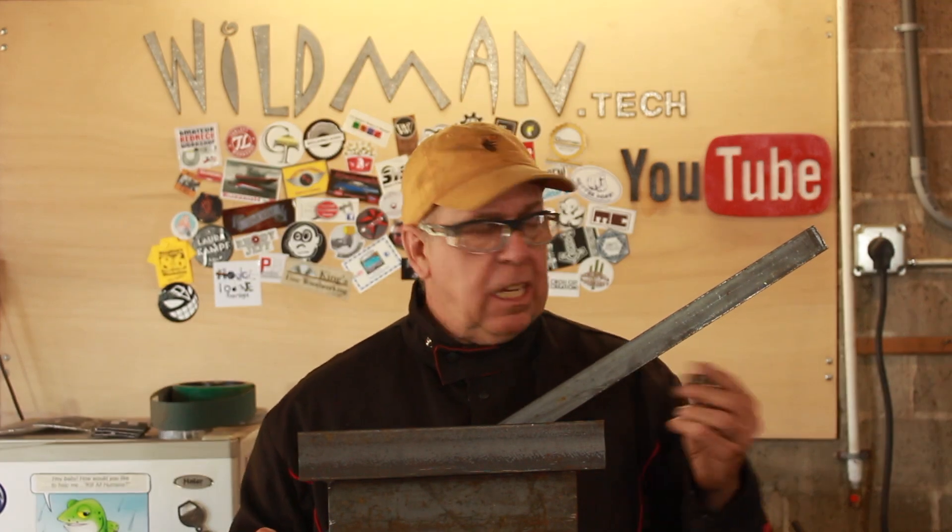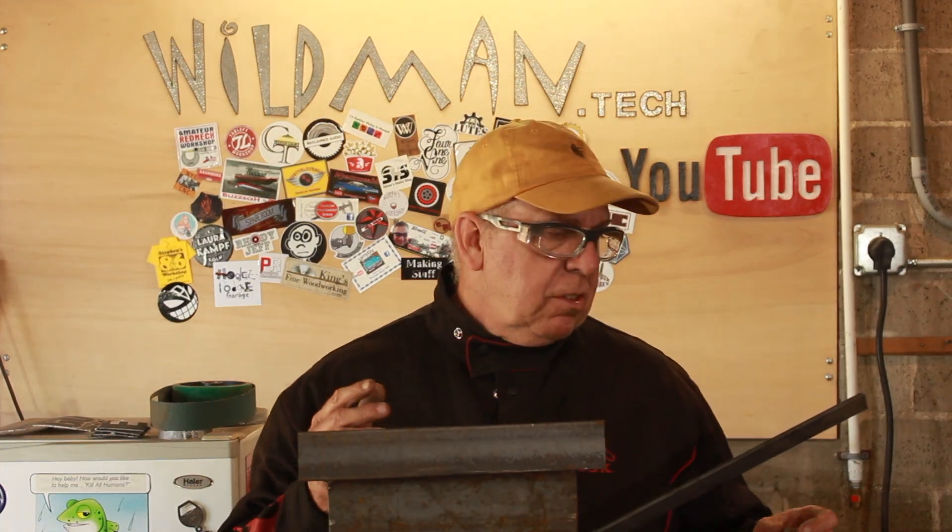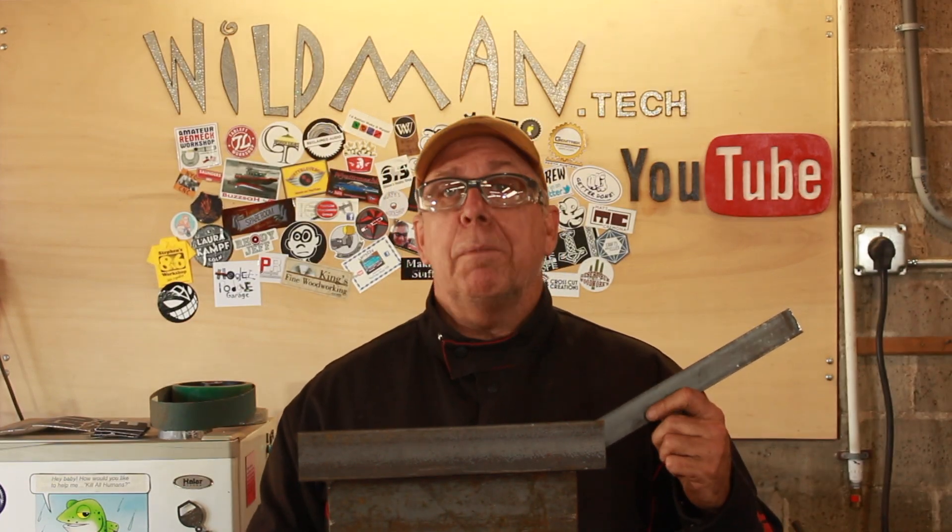The last thing this needs is the interface between the wood and the strain gauge, which will be mounted on top of the bottle jack. The interior dimensions of this coupling need to be a rectangle three-quarters of an inch by an inch and a quarter tall, with this bolt on the bottom, and it needs to be one inch deep. He specified that the rounded edge of hot-rolled steel is not sharp enough, so I'm going to build it out of inch-and-a-quarter flat bar, then grind an eighth of an inch off each side until it's only one inch, giving it a nice sharp edge.